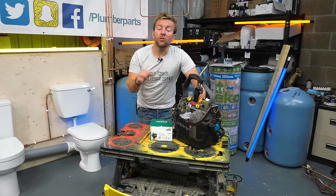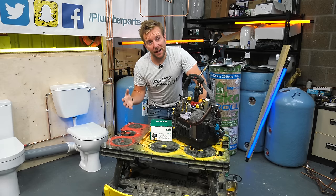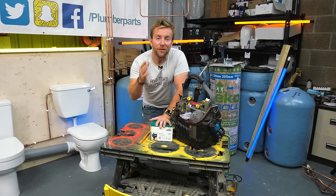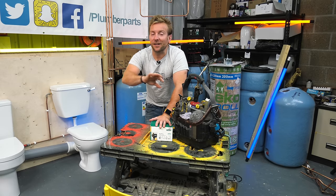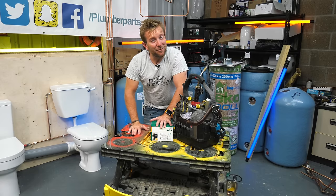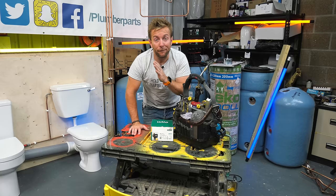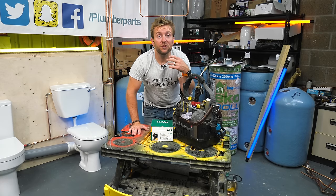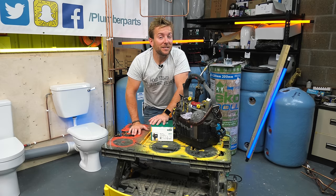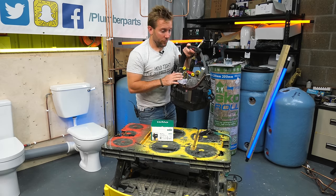So you can see there, what's wrong with the system? It's just a physical layout problem. And it's a bit of a shame that we can't, you know, it'd be lovely if we could fit something on the one pipe that feeds all my hot water taps, and suddenly that made it so hot water came out very, very quickly. Unfortunately, we can't get around that. We have to fit a pump like this. We have to send a flow or a return out to physically the farthest point we want to be able to get to, and I'm gonna be taking this quite a long, long way. So, let me just get my lovely soldering bag out of the way.